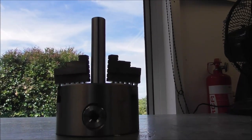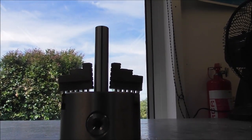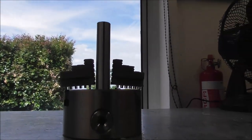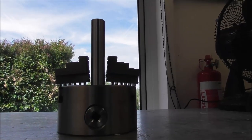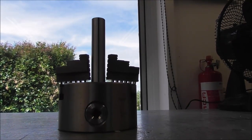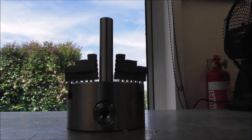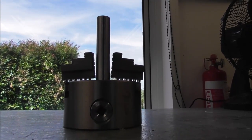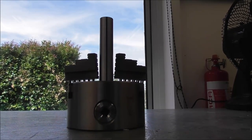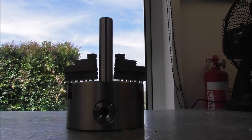Over the years I've been asked to help people with their lathe machining problems, and quite often I've noticed that they have a problem with their chuck. Their three-jaw chuck is either worn bell-mouthed or the chuck jaws are loose in the body — it's an invisible issue they're unaware of, but it's causing major problems of inaccuracy and part stability. The work is moving around and they don't realize it, so they can't take heavy cuts, do precision machining, or do any heavy parting without major chatter issues.